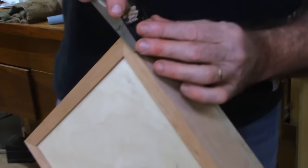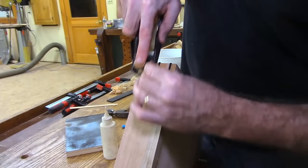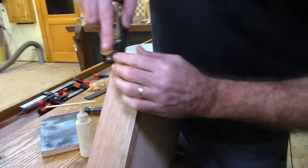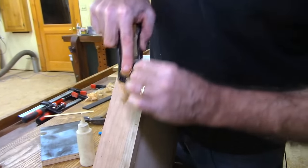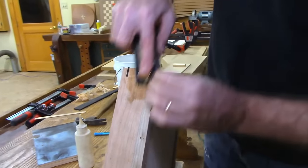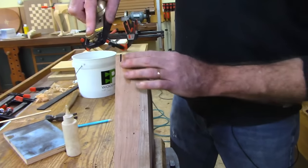I'm going to use my low-angle block plane. I don't think they're going to move at all anymore — I'm not putting much stress this way. The grain is running out this way, so I want to plane with the grain — it's nice because you can just go downhill like that, just till you get flush. Do you choose splines because they're decorative or for strengthening? Both. I honestly don't do this a lot — I don't make a lot of boxes. But I have made picture frames where it's nice: you glue up your miter and then throw in the splines, and you've got something really nice and durable.